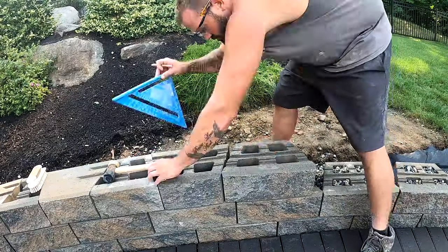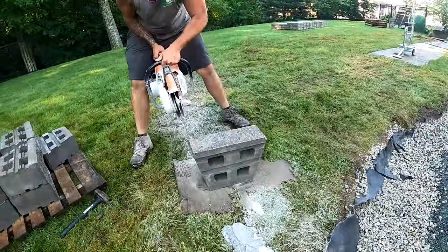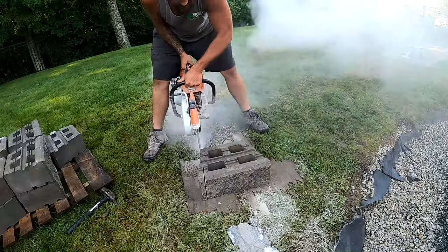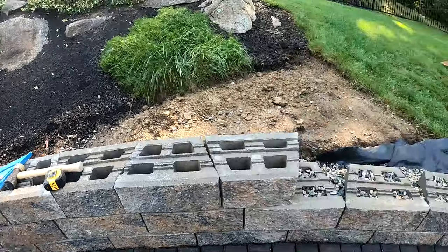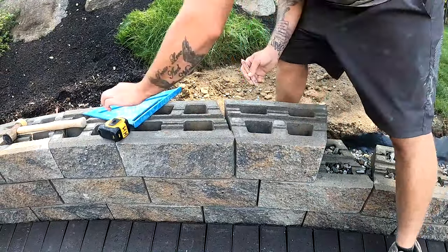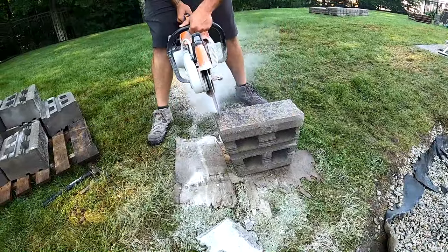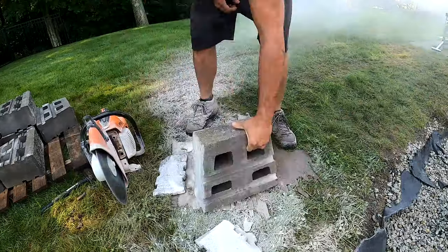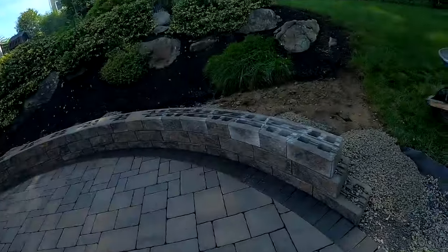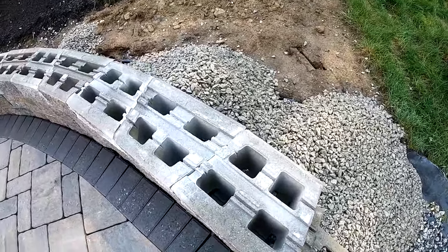Here I am just kind of wrapping up this last layer of wall block. The next video is going to be how we split and install the corners of this wall — that's a nice short video under eight minutes. It just really ties a wall together with a nice split-faced corner as opposed to a smooth-faced corner. The top row, double-sided row, is all set and looking pretty good.